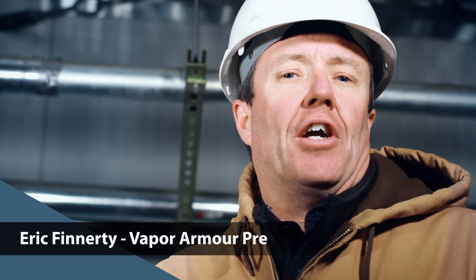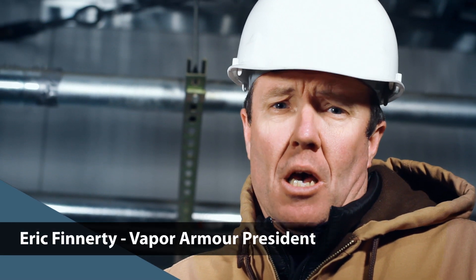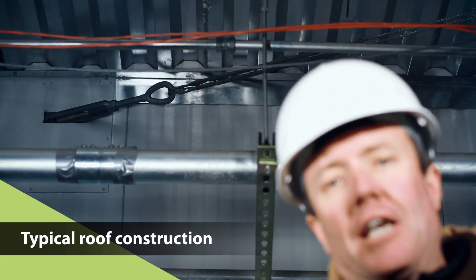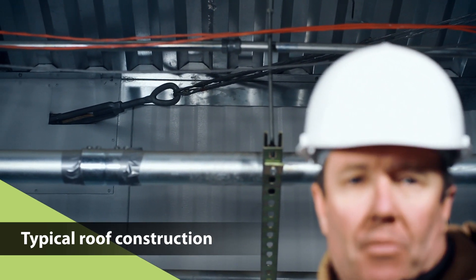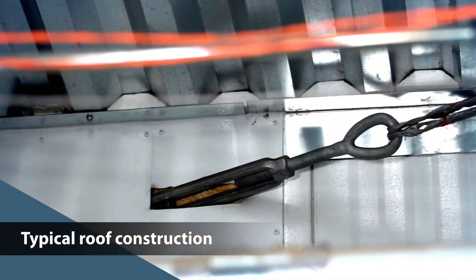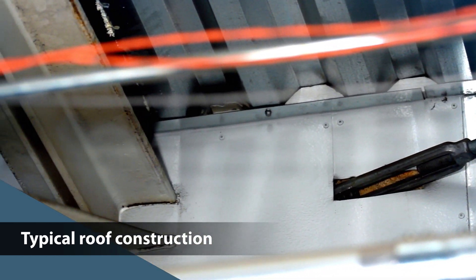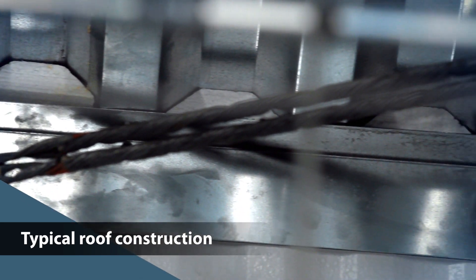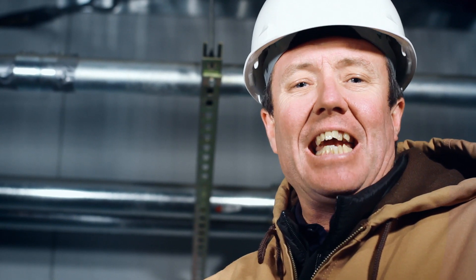Here is a view of a very typical IMP panel in roof connection. On the opposite side of that wall is the battery room. It's approximately 75 to 80 degrees in there. As you can see, the method of separating this — they have used pound and a half EPS foam filler and 90 degree metal to stop the air infiltration from coming in here.